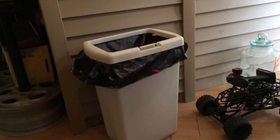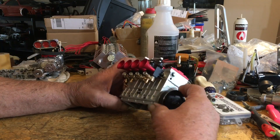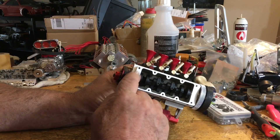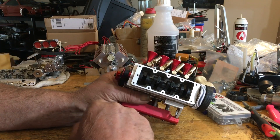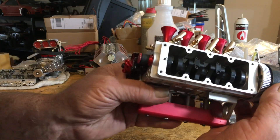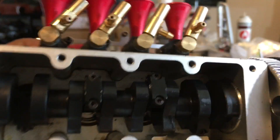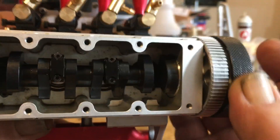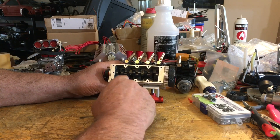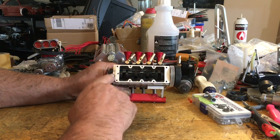Fix that. Okay guys, so I put the crank in it — I found that cool way to put the crank in from my last video. I put the set screw in it like they said, snugged it down so it won't walk, and I didn't tighten it too tight. I went to fire it off — and guess what? Crank broke. It fired, and bup bup bup snap — it broke. But this time instead of breaking at the front, it broke at the back.